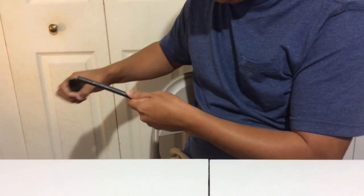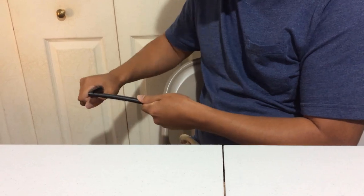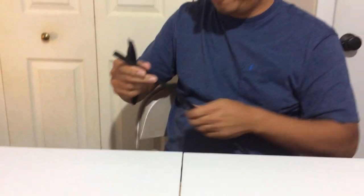I'm going to go ahead and peel back the plastic here and then it has a metal jacket. So first of all, you take this plastic off. You can see I'm getting to the metal already. But I'm just joking — this is not the way you do it. I once saw somebody try to take out the plastic the way I was doing it and then removing the metal jacket inside, but that would take too long and you might damage the fiber inside. So this is a better way to do it.